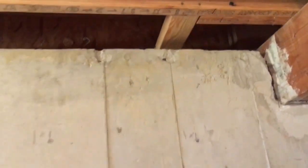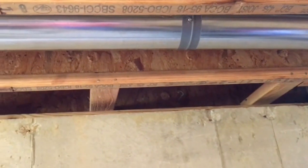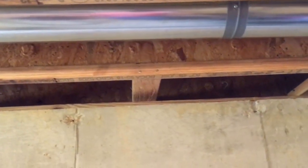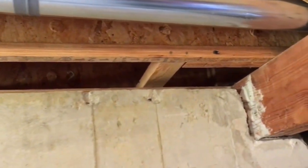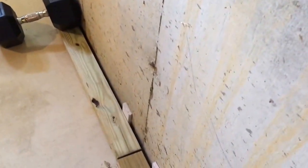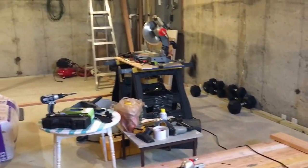On this side, to frame the wall, I also put a couple of cross members in. Because I didn't have another joist to attach to back there, I cut them to size and nailed each one straight down into the sill plate sitting on top of the foundation, then nailed them into the first joist. That gives me a place to attach the wall. I dropped the plumb line so I could have the floor plate exactly where I want it - half inch off the wall to give myself a little clearance. Now I'm ready to start building some walls.